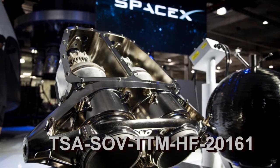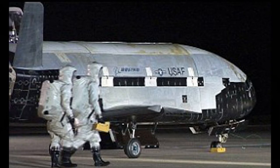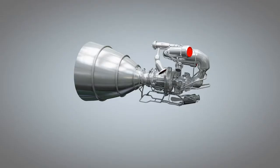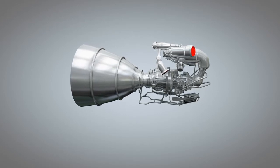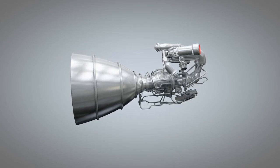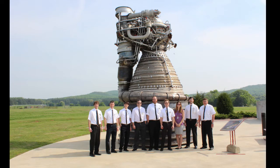Watch our course on hypergolic rocket engines here to refresh your knowledge of this technology. But these chemicals are toxic and have a lower specific impulse than other rocket fuels, including plain old kerosene. Expensive refined kerosene for rockets is called RP-1; for jet airplanes it is called JP-8. But kerosene is hard to light — spark plugs won't work. Modern diesel engines use extreme compression, but this won't work in a combustion chamber open to the outside through the nozzle. So how do rockets and SR-71 engines use this more efficient fuel in their larger rocket engines when their fuel is not hypergolic? And how do they restart them?